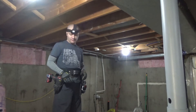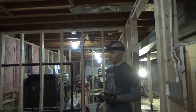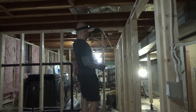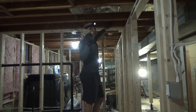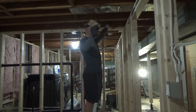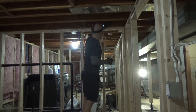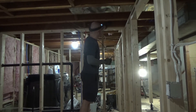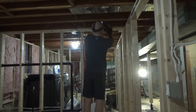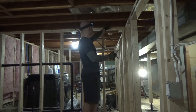This is one of the things you run into when you don't really plan and kind of make it up as you go. I had originally planned to run two pairs of coax and Ethernet through these holes, which should have been enough, but I didn't think about needing one more coax cable coming all the way back to the mechanical room where the cable internet comes into the house. I'm fairly certain I can get four cables through but not five, so we're going to mark another hole beside each of these to get the last run from the upstairs bedroom through the joists.